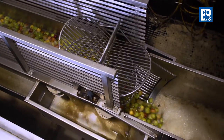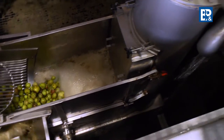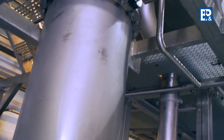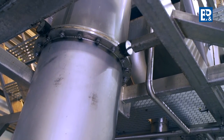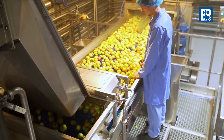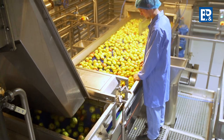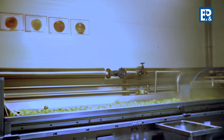The vertical elevator transports the fruit to the inspection belt. At the end of the inspection belt, through a system of spray nozzles, the fruit taken from the silos by a sorting unit is transferred to the pulp preparation section. Another stage of the juice production then starts — that is fruit pulp preparation and processing.